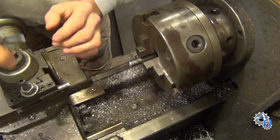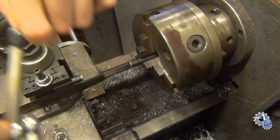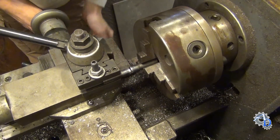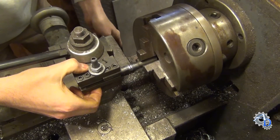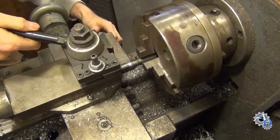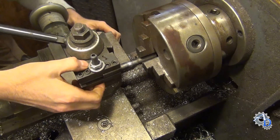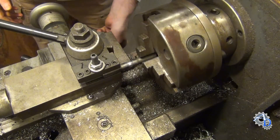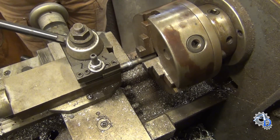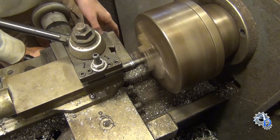I've indicated in that part now. I just need to line it up with the part in the chuck — that's going to be the tricky part. I think I'll have to get it pretty perfect, but it looks pretty good right there. That'll work. Now I'm going to turn the speed down to about 1,000 RPM — I had it at 2,000 RPM before.